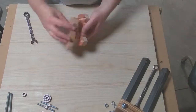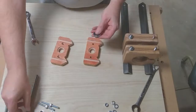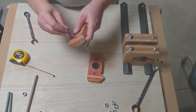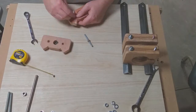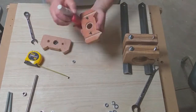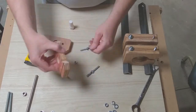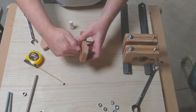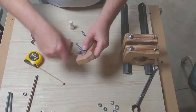The next part of this assembly is the top bearing plate for the Z-axis motion. That's a 10mm acme pitch screw and it's going to fit inside that 10mm inside diameter bearing, which is going to be sandwiched between those two pieces. These threaded rod sections are going to be part of the assembly that mounts and secures the motor to the jack screw, and that will be in a future video.